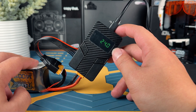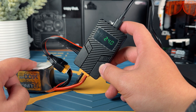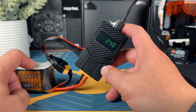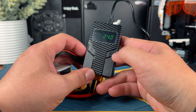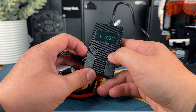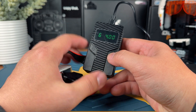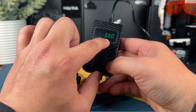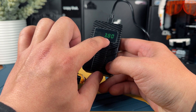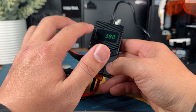Another important function is that the discharger is also programmable. You can set it up to stop at a certain volt per cell to prevent over-discharging of your LiPo. It's pretty good to use this to discharge your fully charged LiPo down to storage charge. To program it, there is a gear button — if you press it once, you can see it shows you the voltage level from each cell. If you want to program how the charger stops at a certain level, just long press the gear button. You can see the number is blinking, indicating the charger is currently set to 3.8 volts per cell.